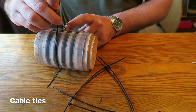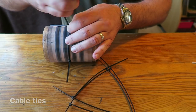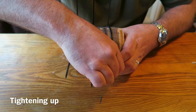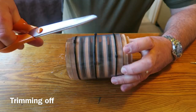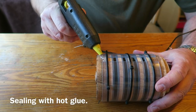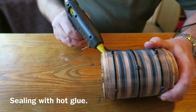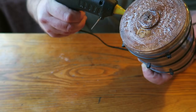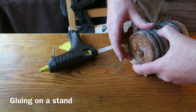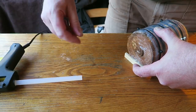I'm now fixing my mould housing — or shuttering — using cable ties. I'm joining three short ties to make one long tie because I didn't have any longer ones, and that just holds it neatly down onto the blank. I've got my recess at the top so I can pour the resin in. Now I'm sealing everything with hot glue — hot glue is brilliant for mould making: it holds everything instantly and seals really nicely. I then hot-glue a piece of wood onto the end just to stop it rolling around and the resin pouring out.